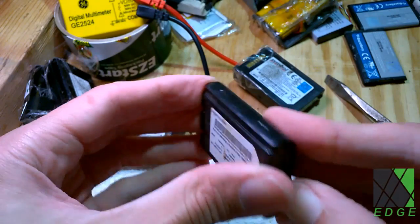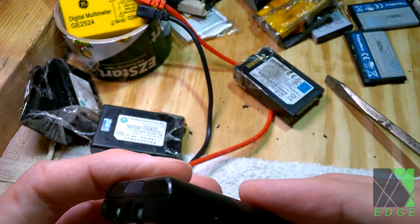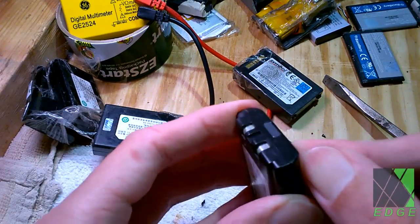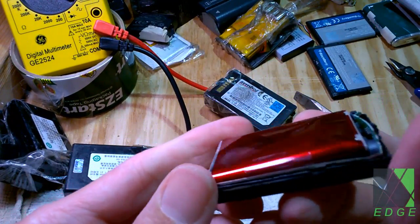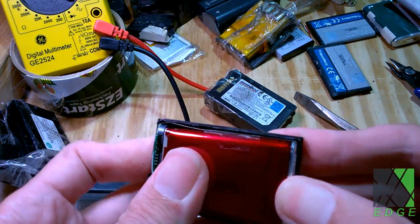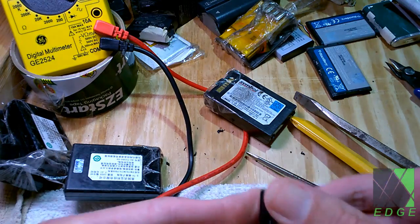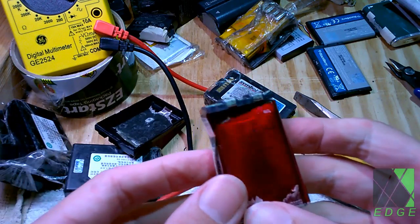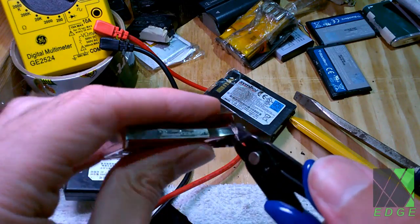The challenge is going to be getting all of these cells into one battery pack — that's a lot of work because these are all different. These terminals have a little bit of corrosion, which could mean something is wrong with the batteries inside, or they were just abused. This one I smashed with a hammer on concrete — I wore my safety glasses. It looks like a pouch cell inside. I smashed it pretty good but this is a destructive process. There's a little circuit here and I've got to be careful not to short it.